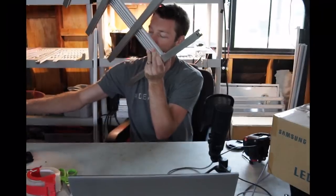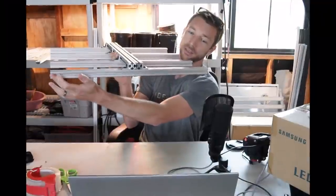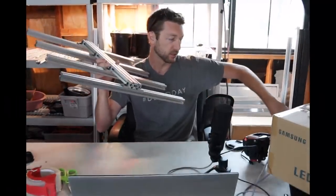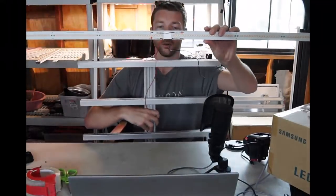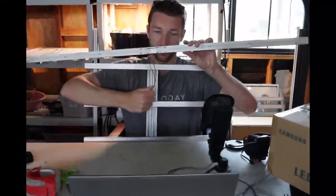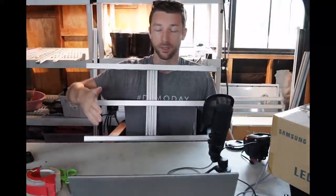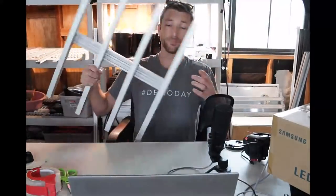I suggest the spine build — it hangs the best and is the easiest to do. You could take single bars and put them out at the ends as well, but for a 16-strip build or four-foot-wide build, a spine is a lot easier to wire. In the last video I showed how to do parallel-series wires with all wiring right up the center, and with a spine we can run wiring straight down cleanly and easily. Other than that, there's no change to wiring, no change to driver recommendations — still recommending 0.75 to one strip per square foot based on intensity, constant current wiring.